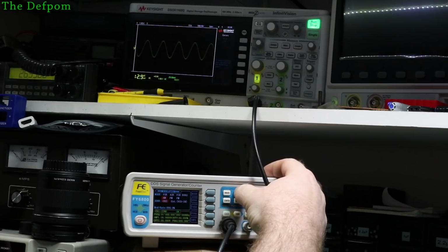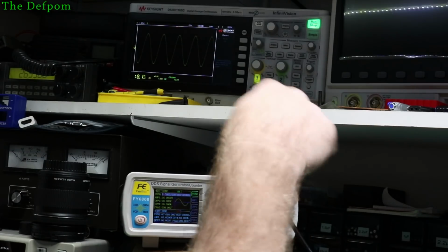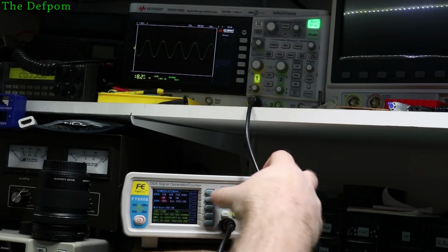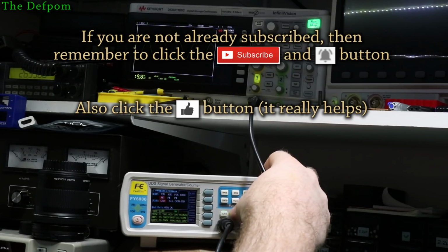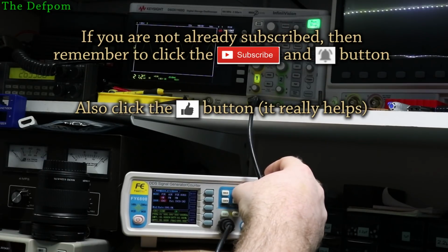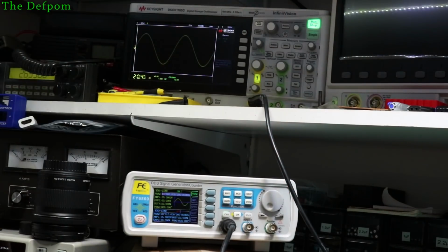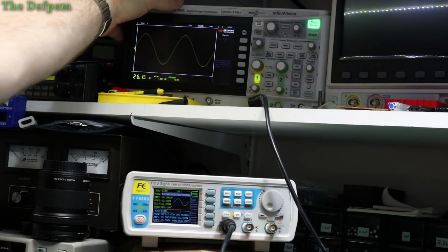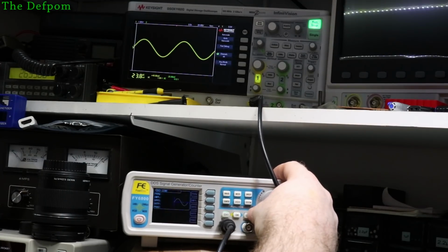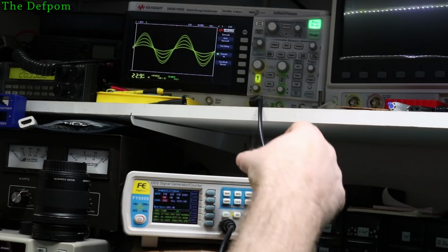So you've got the modulation one as well. That does actually work. I'll just have to remember to use it. So it's set to 1 megahertz with the modulation set at 90% on AM. Okay. There's a way of turning this thing on and off. I can't remember what it was. I've forgotten. I did it before. It's not 100% obvious. It's made a 10 megahertz waveform, like so. Hope you can see it on screen okay. This looks a bit dim actually. There you go, that's better. So modulation. There we go. It's kind of doing something now.